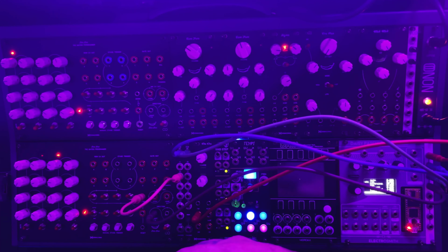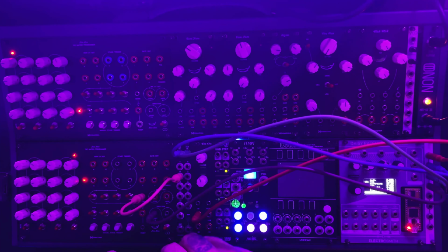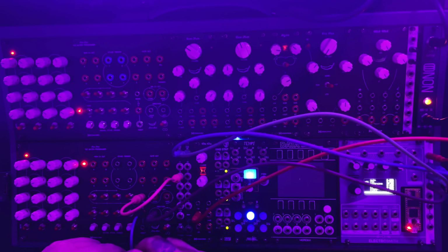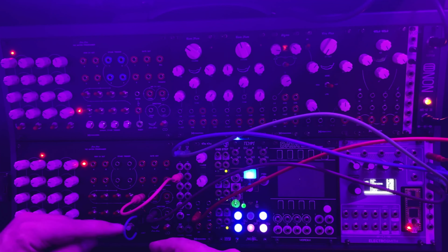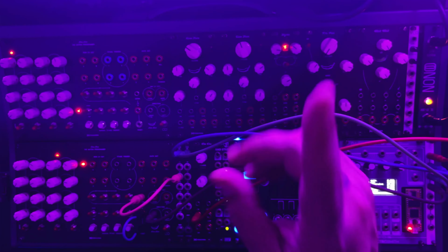So I also need to reset the vertical clock every 2 rows, and I actually have an output just for that here. You can just use it. It's this one here with the divided by 2 text on it. You call it to the reset. And there, now we have an 8-step sequence going on here, and we have another one going on here on the different output. Okay, whew, first sequence done.